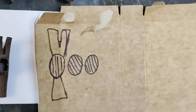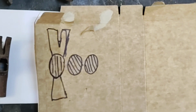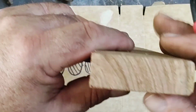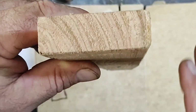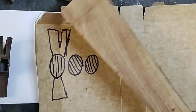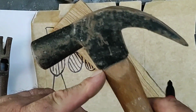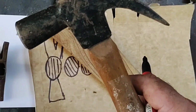When you start going up into your sledgehammers, etc., yes, I think it's pretty crucial that you get the maximum strength. Now, why do I say that? I'll explain some things. I'll just grab this bit of timber for a rough idea. If you had your grain going like this, what I found over the years when handles break, it's because of misuse mainly, but a lot of times it's this part of the handle. I'll just zoom out again, sorry, I'm zooming the wrong way.